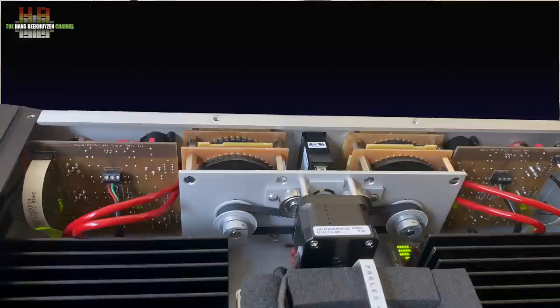The way the rotary switches are operated is remarkable. A stepper motor is connected via a cogged belt to the two axes of the double rotary switches — which of course need to be double since it is a balanced design. The mechanical construction is beautiful with two bearing-mounted pressure rollers. Despite this, it is somewhat noisy and has actually surprised visitors, sounding somewhat cheap. On the other hand, it offers the option of working as a power amplifier for the left and right channels of a surround processor. When you set the processor passthrough for an input, the amp simply turns the volume control full up; when switching back to another input, the volume is set to the last level used on that input. Brilliant!